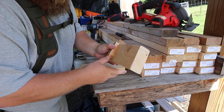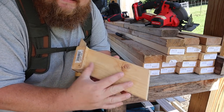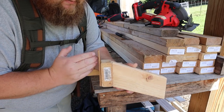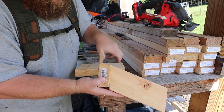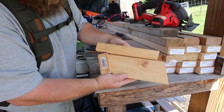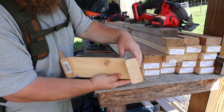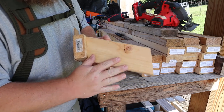This whole setup is just to build a little jig to find the actual angles and lengths of what I'll call short rafters for the eaves, so I can replicate a ton of them. This two-by-four goes against the house — it represents the side of the house. The roof piece comes up at an angle, leaving a small triangle gap, which is normal in roof framing. I want to make sure that when I add the fascia board, I'm still within the correct overhang for the plywood. Everything looks good — now take it apart, measure it, and replicate it a whole lot.